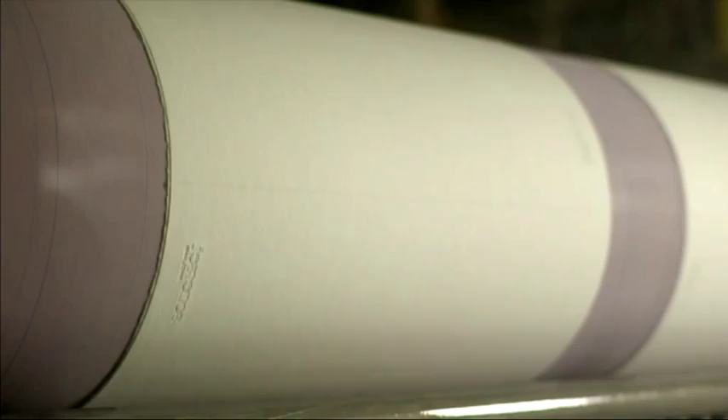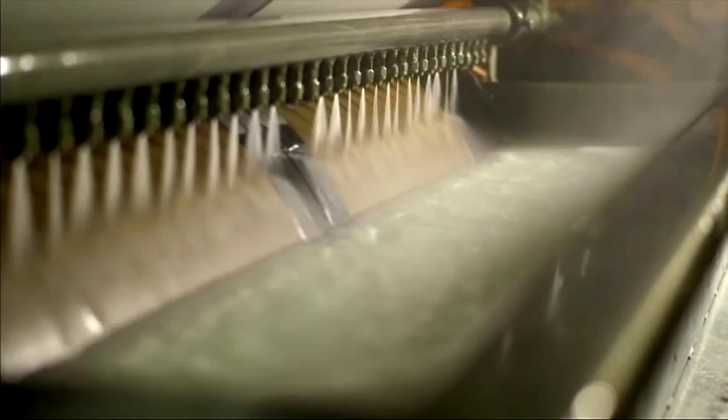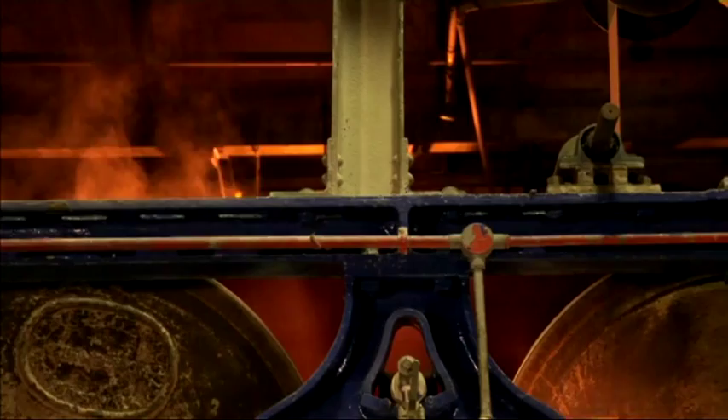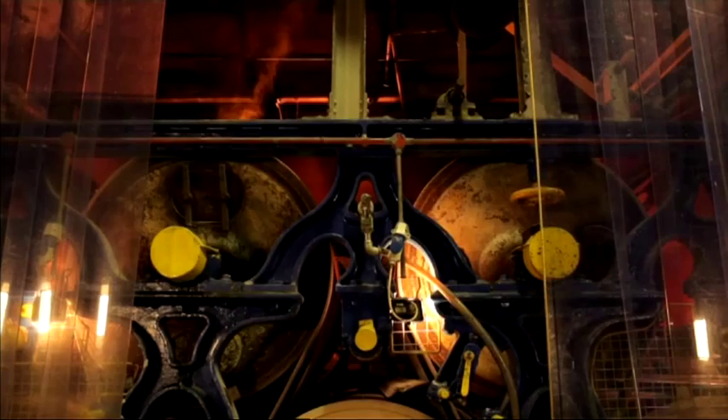The finest clean pulp — either cotton or wood — is added to the vat and beaten with water and other largely natural raw materials like starch, clay and chalk. This is then pumped into the vat. Our paper machine is a cylinder mould machine built in 1907 — one of only five in the world making artists' papers and the second widest. The cylinder mould lifts the fibres from the vat to form a sheet. The fibres are arranged in a random fashion, which gives the sheet inherent strength and a stable surface. The mould also adds the watermark and creates two of the feathery deckle edges on the sheet. This sheet, now a continuous strip, passes through natural woolen felts where the random surface texture is applied and water removed.